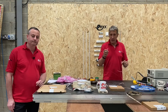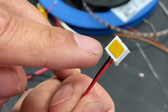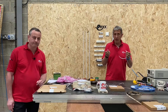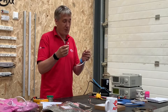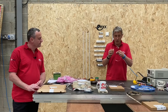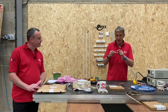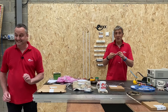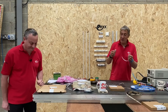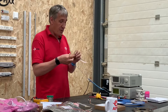This IDC connector is particularly good. It has a small adhesive pad on the back, which is useful because once you've made the connection you don't want the connector flapping around and possibly pulling the tape off the surface. These are fragile connectors — you can accidentally close them before putting them on the LED tape, and once they're closed up they're pretty tough to get back open again.